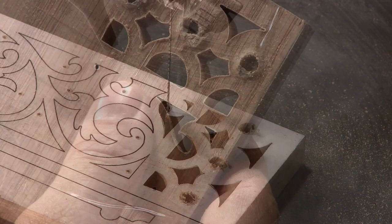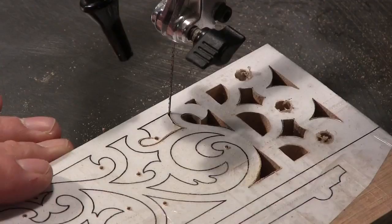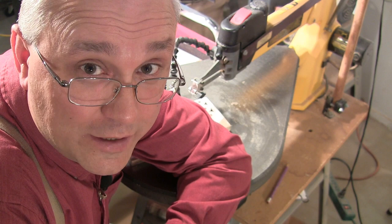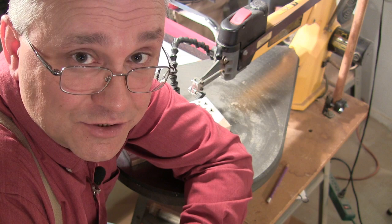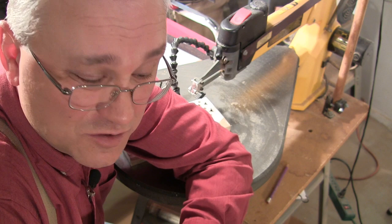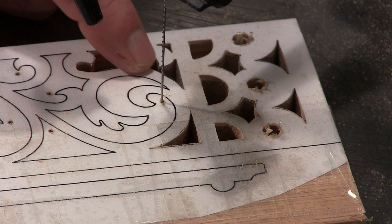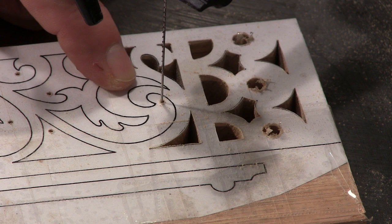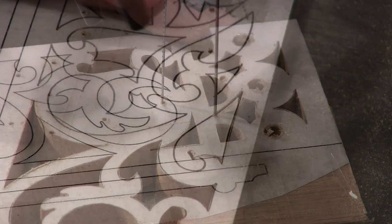Let me give you a little trick and secret to scroll sawing. A lot of times when people get off the line they'll get right back to it real fast, and that's a mistake. Come back to it nice and slow and even. Based on your pattern and the line you're dealing with, especially on curves, if you get off of it a little bit people are never going to notice. Whether it's an inside curve or an outside curve, just parallel the line and come back to it — when that pattern comes off nobody's ever going to know about it with all the scroll work.